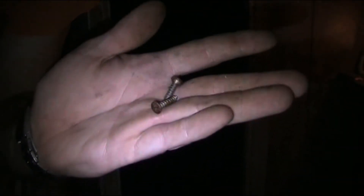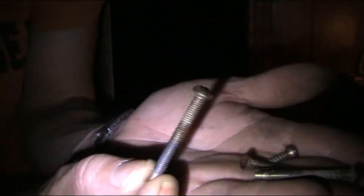To remove the latch from the door — this is old, so I will go ahead and replace it. Still just a screwdriver, but it's into the actual outside ledge. See, these screws are a little bit different since they screw into the wood — they're real short and coarse. Where these are the handle screws, they're real long with a fine thread. Then you slide the tongue out — sometimes it does get stuck. Make sure and put your tongue the way of the latch, because when it closes you want it to be able to push in. If it was backwards it would just hit, and we don't want that.